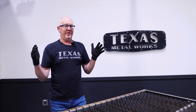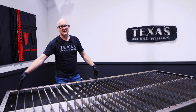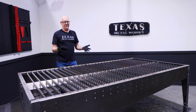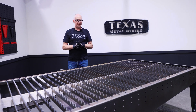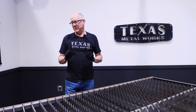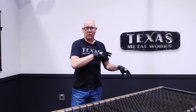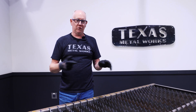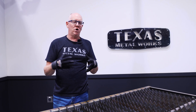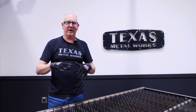There is one other variant: a four-by-four version — just imagine exactly half of this table. So those are the three options in the plasma cutting lineup. If you're building your own DIY CNC, you can also use the holes on the sides for mounting a rail system for your CNC to travel up and down. We don't have a lot of adapters for that yet, but if you have something specific in mind, just ping us and we're happy to design a mounting methodology that will plug into this table and make it available for everyone.